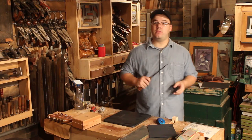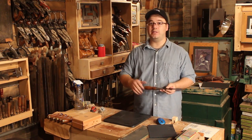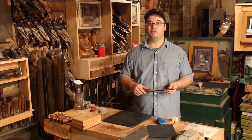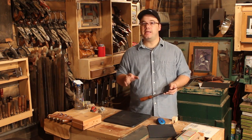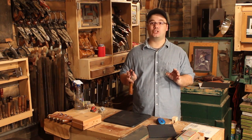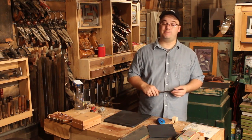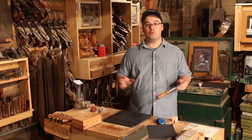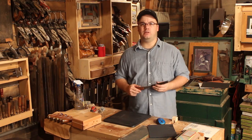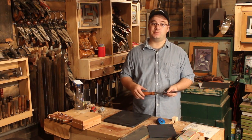Now woodworkers smarter than I am and more experienced say that you can stop at 600 grit for a lot of blades, especially bench chisels and tools you're going to pound on. Planes and paring chisels should go higher, and 2000 makes an extremely sharp edge. Others like to go a lot higher than that, especially on fine tools like smoothing planes. We'll get into microfilms and stropping and stuff to get those really fine edges in a future episode.